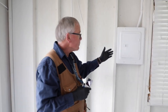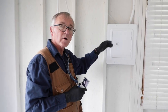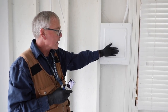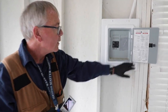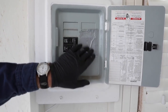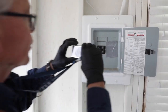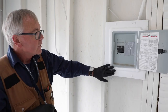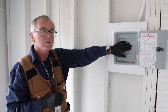Now we're going to take a look at the main shutoff for the distribution panel. This particular main is on the opposite wall from the distribution panel in the garage. We want to do the backhand test right away. We open it up and we can see that we have one main breaker in here. I also noticed right away that we've got some duct tape over some open breaker holes, so we need breaker fillers in here for safety. We'll photograph that and the overall main enclosure — the two things I've noticed are the size of the main and the missing breaker enclosures.